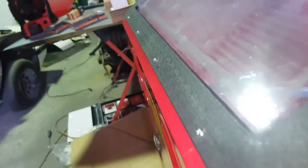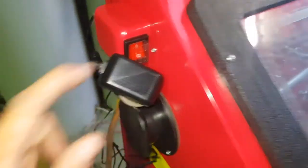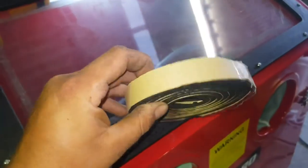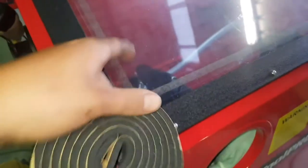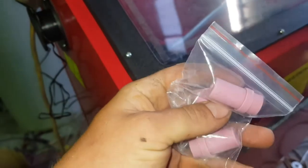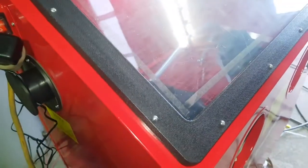A couple of operating precautions: 100 PSI maximum, and just keep an eye on your gloves to make sure they don't have any cuts or marks in them. All of that comes with the kit — all you have to do is plug the plug pack in to run the light. It comes in a little box. You get a spare foam seal, which is just like weatherstripping for your door frame, so if you ever have to take the glass off you can do that. You also get some ceramic nozzles for the gun in a couple of different sizes — a big one and a smaller one — so you can control the amount of media flow.